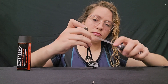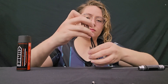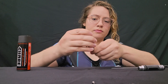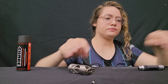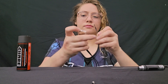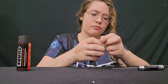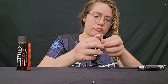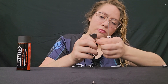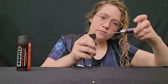This should help keep you from dropping them. Second verse, same as the first — let's do it again with the thermistor. Apply some thermal paste, find the hole, and loosen up that little grub screw. You don't need to loosen it all the way — it should just fit in there. Tighten it back up, but not too tightly; you don't want to damage your thermistor.